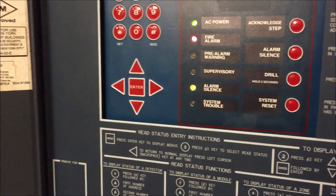There we go. The alarm has been silenced; strobes continue to flash because they're on the DSM sync module. This one also buzzes like the LED EST Genesis I have, which is kind of interesting that they both do that. All the strobes continue to flash in unison. Panel is silenced.